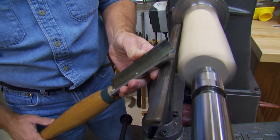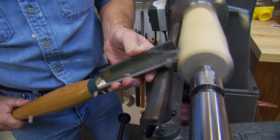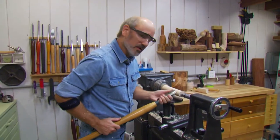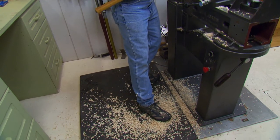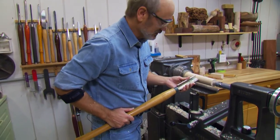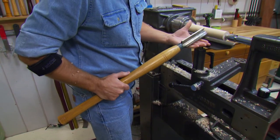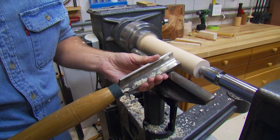You don't want them going any faster than this. You want them to do this slowly because they're learning how it feels to have the tool touch the wood. If you have a child who's a little skittish, a little scared, you can go ahead and rough out the wood until you have a perfect cylinder. Remember, this is where stance is really important again. If the kids have their feet wide, then they can do the dance — you lean back and have the tool up against the wood, then simply shift your body. Keep the tool into your side, have your hand grasping the tool, and use your fingers as a backstop. Don't have a death grip on the tool — simply pinch it lightly between your fingers and slide.